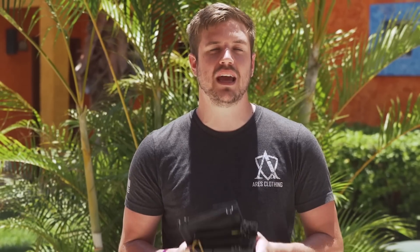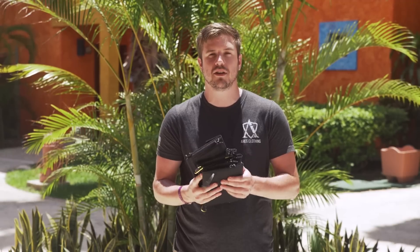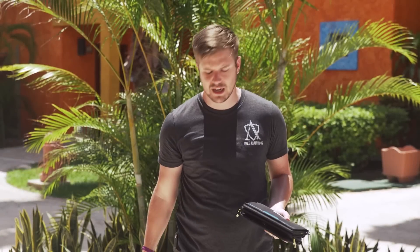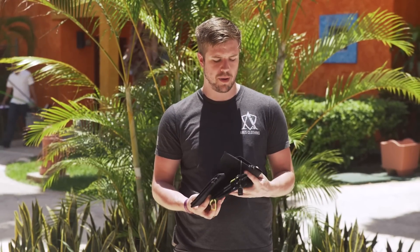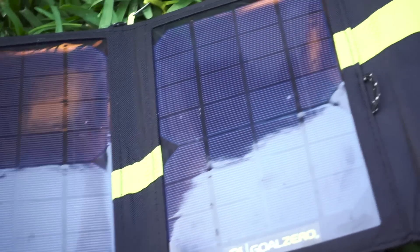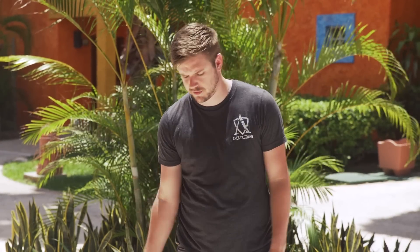Our camera is giving us a temperature warning and honestly I'm done. We've tested in the sun, in the shade, at improper angles — all that kind of stuff. I don't think brand ended up being a huge factor here. What ended up being a huge factor was surface area. The big massive one with three panels and a taller overall design did quite well in both shade and sun. The Anker and All Powers performed more or less the same. The Goal Zero, with its glossy panels and smaller overall panel area, didn't do quite as well as the others. Fairly straightforward.